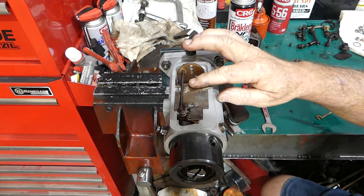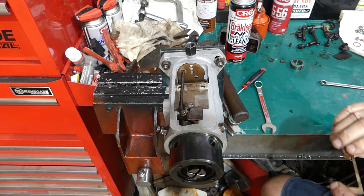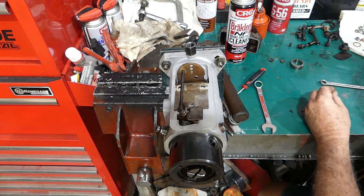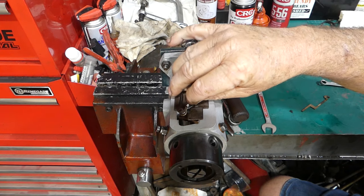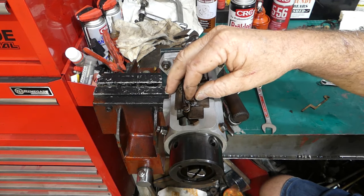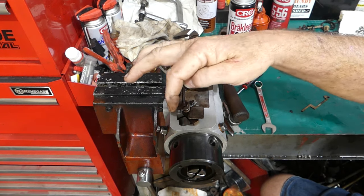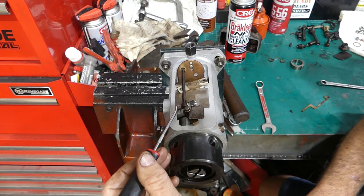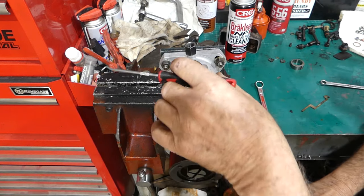There's a little plate that goes down on top of the metering valve. Now is an ideal opportunity to find your little lock tab for that plate — pop it down over the edge and get that little screw in. The lock tab's little dropped corner goes on the flat just in there, then we firm that up, and the O-ring pick holds it in place. That stops the plate from moving.